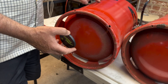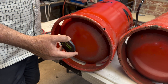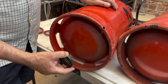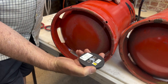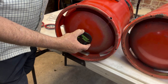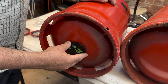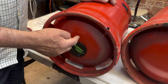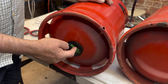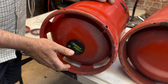The float mechanisms are usually off to one side - very seldom directly in the middle. I'm going to put this straight in the middle. There's dielectric grease there and I'm just going to push this straight onto the bottom, pushing the grease so that it's flat. I know without a doubt there's no air layer between the sensor and the metal.